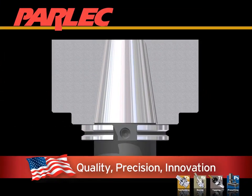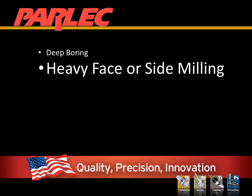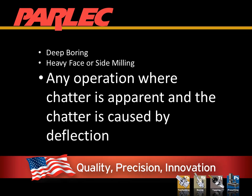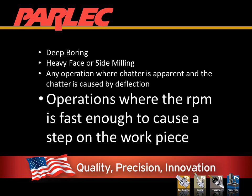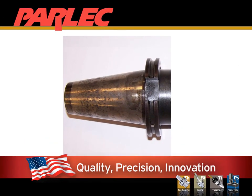Who needs Simulfit and why? One obvious application is deep boring, where the added spindle stiffness will reduce deflection. Heavy face or side milling where deflection is large, and any operation where chatter is caused by deflection. Operations where the RPM is fast enough that the holder draws in and causes a change or step on the workpiece surface. Conditions where cold hammering is visible on the large diameter of the taper — a condition where cutting forces overcome the connection, causing hammering between the tapers. It can also be a failure of the drawbar, and Simulfit may not correct it, so checking your drawbar force is an important process in any shop.